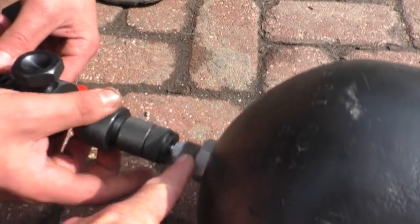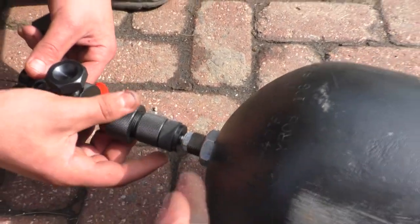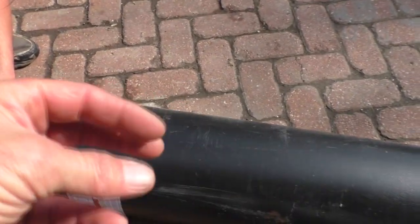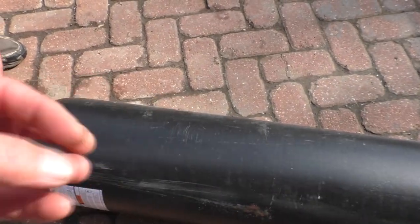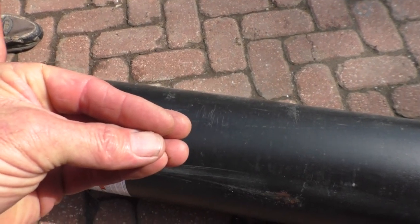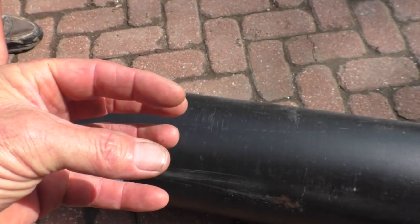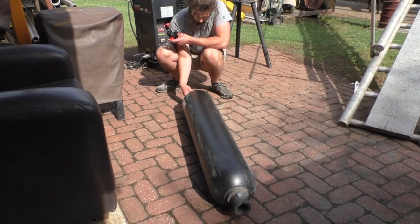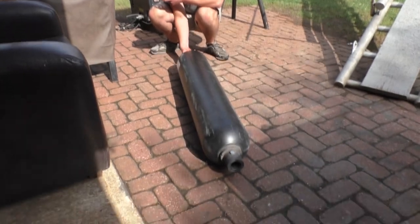So this part right here is actually part of the bladder. It's just sticking through this housing. So bladder on the inside with nitrogen gas and oil around it. And the bladder gets compressed by the oil. And then when you turn something on that needs a little hydraulic fluid, that bladder expands back out and pushes oil out. So it's a 10-gallon tank, but you can only get 2 gallons of oil off of it, depending